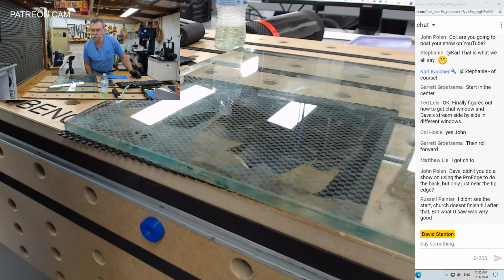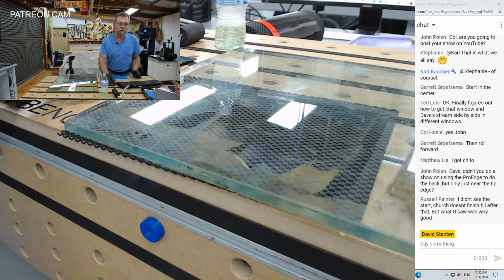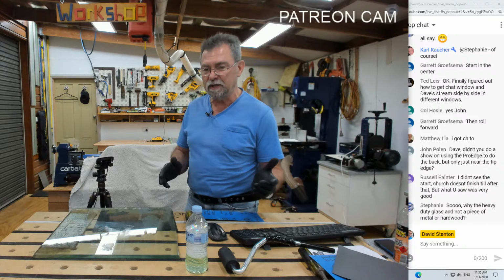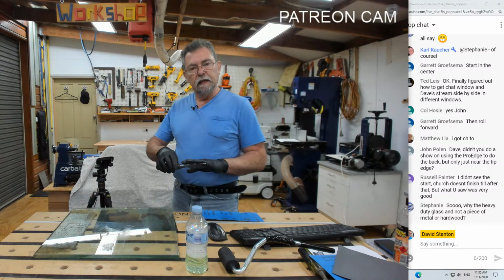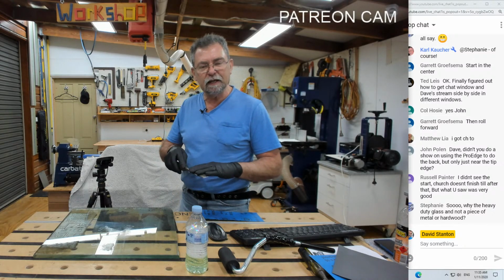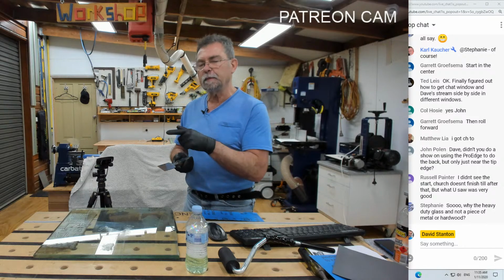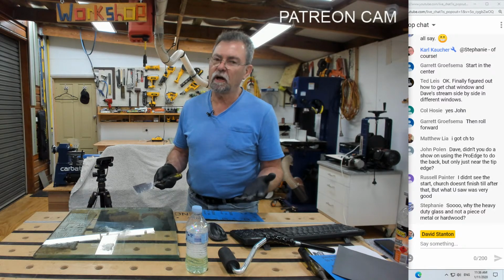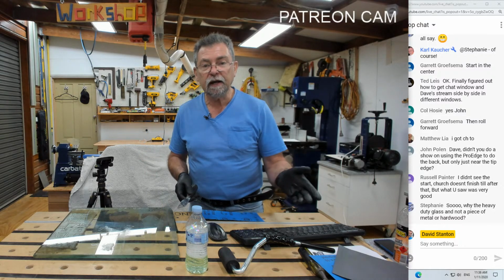John, Dave, didn't you do a show on using the Pro Edge to do the back, but only just near the tip edge? Look, in the early days of having the Pro Edge, I gave that a try, and it was a fail. It was an abysmal fail. What happens was, because the machine is so aggressive, it would grab in one spot and heat up too quickly, and there was a whole lot of metal to come off. I've just found that using the diamond plates on there very coarse to start, and then jumping onto the sandpaper is a whole lot safer for the chisels. The Triton using the wet wheel, it's fine, it does the job.